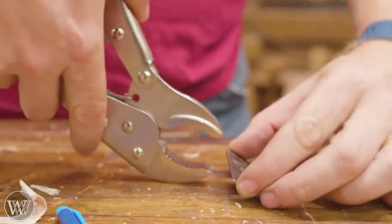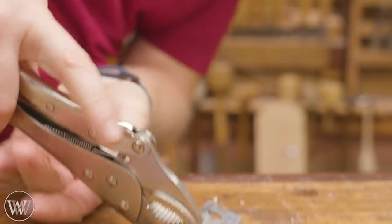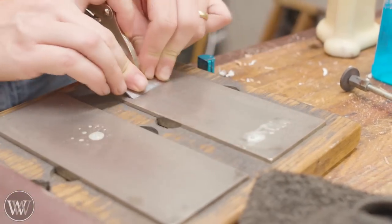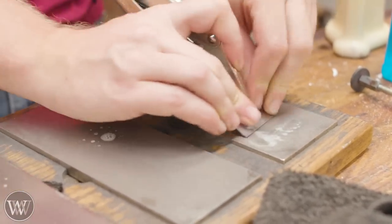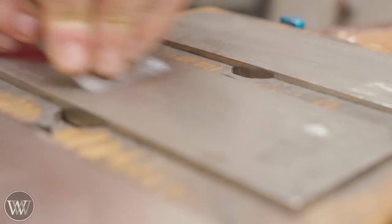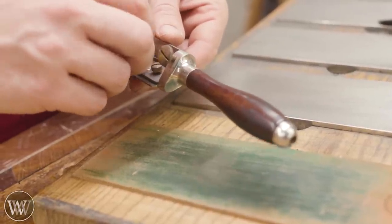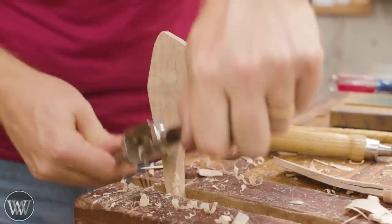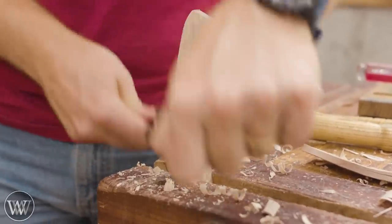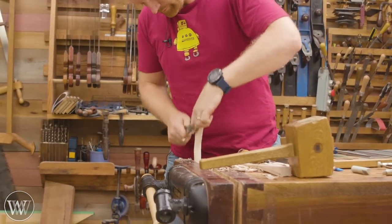Now that we've gotten it roughly to shape, we're going to bring in the spokeshave. After working with it a little bit I realized it's dull — I did a video all about spokeshaves which I'll link below. I forgot to mention in that video about using a vice grip to hold onto small pieces like this one, because it's really hard to hold onto with your fingers. Hooking it on the vice grips works really nicely — it basically becomes a honing guide. Then we can put it back in and put it to use. It's amazing how much a sharp edge really makes everything better: less chatter, less skipping, it runs easier and catches the grain. It's a smooth, clean cut.